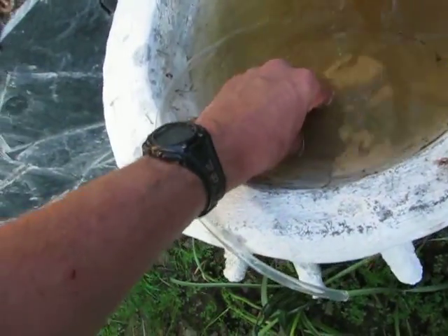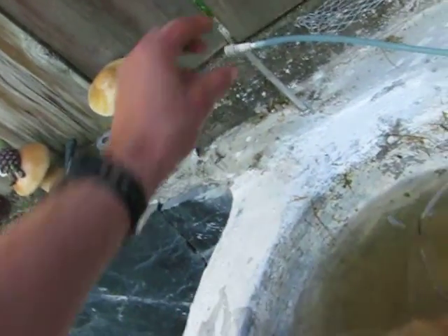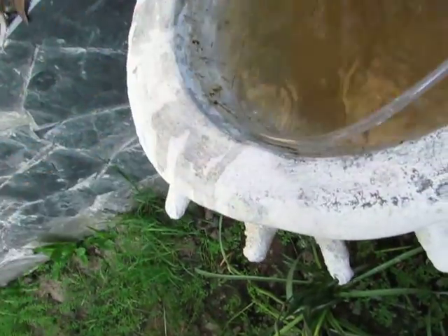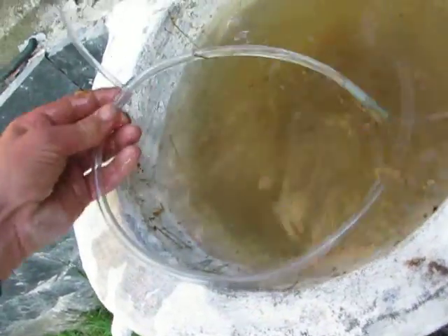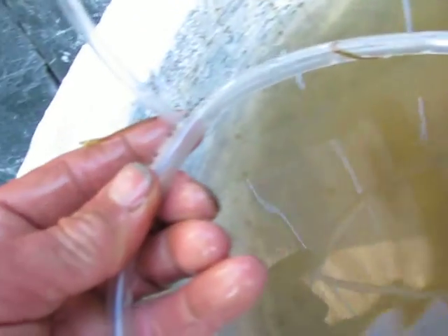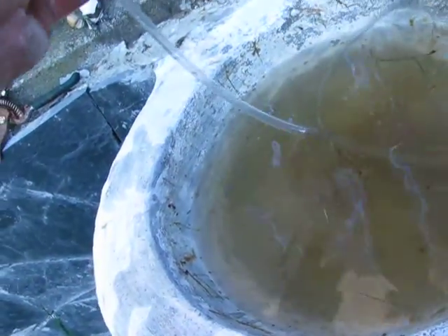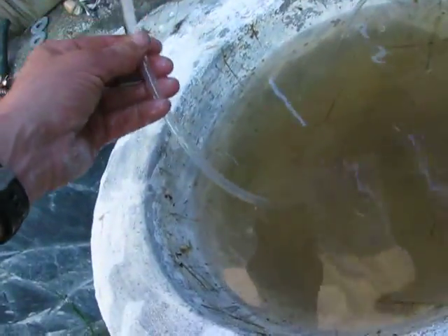You can pump higher than the fence. This is just to adjust the speed of it. This has to be down. It can pump very fast. So there it is again — you have about 10 inches of 4-inch tubing, the constriction which is a smaller tube, one to slip over it, the air in, and your tube up to wherever you want to pump. And that's it.